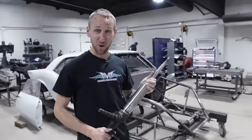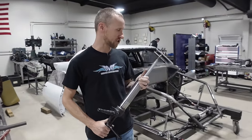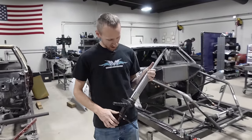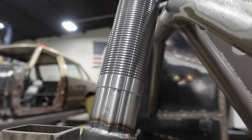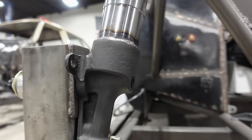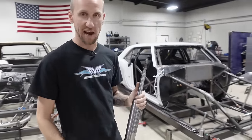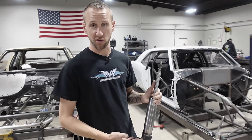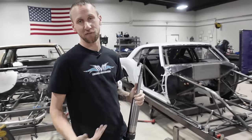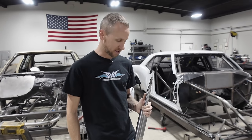Here's your special delivery. So we just got these in the mail. These are our custom Menser struts that Menser built for us. You can see here they actually machined these bodies for us and welded them on. This is a cast piece from AFCO, but they machined a body for it and then found a shaft out of another shock that would work in here to try to get us a shorter strut to fit underneath the front end.